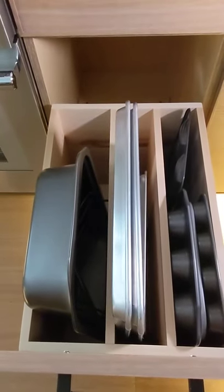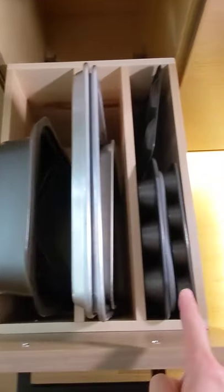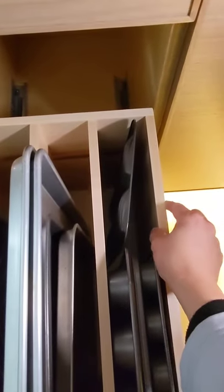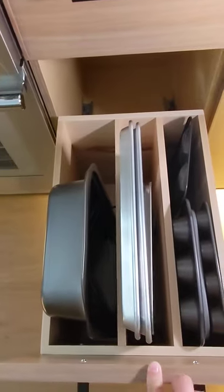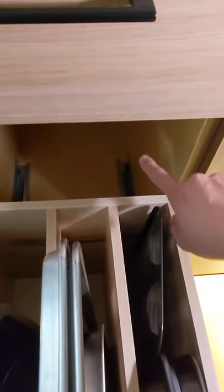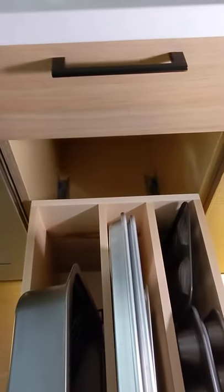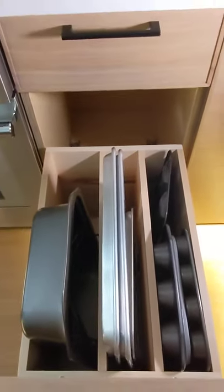With a 16-inch cabinet dimension, I'm able to fit about a 5-inch partition on the left, 3 inches here, and 3 inches here. So that's 3 and 3, which is 6, plus 5 — that's 11 inches — and then we have the thickness of the partitions. The drawer box itself uses 5/8-inch solid wood maple, and with 4 of those partitions you're just a little shy of 3 inches. So we're at 14 inches, plus the thickness of the sides — these are 3/4-inch thick side panels, which makes an inch and a half together, and that's just about 16 inches right there.